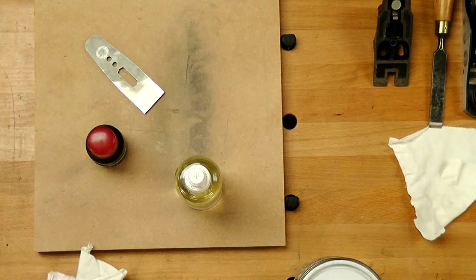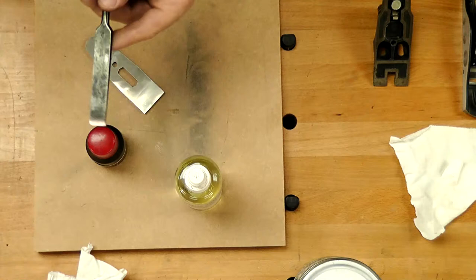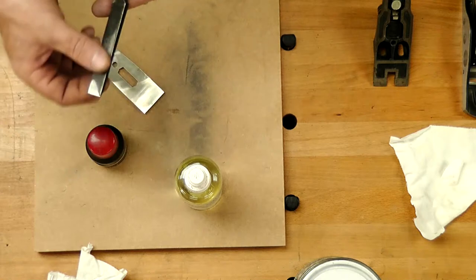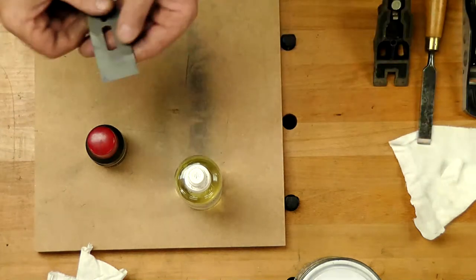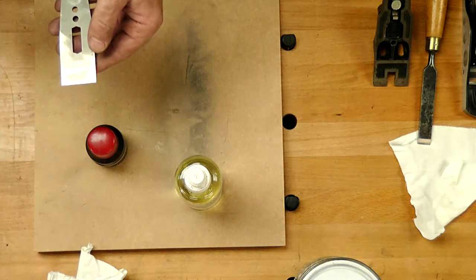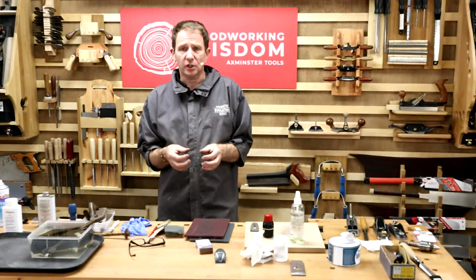All right, Craig, come in then. What have you got? Yeah, Maria's asked, if rust on a tool has got so bad that the surface is actually pitted, is there anything you can do about that? Does it matter? It's a lot of hard work. Depends on how deep the rusting's gone in and what it is. Something like the chisel that I showed you, we were quite lucky with, because most of the pitting was on the top. So we managed to take that out. Underneath wasn't too bad. If you get lots of pitting into the surface of the cutting edge, forget it. You could spend more time trying to do it than the tool's actually worth. We had a guy come in ages ago who brought in a set of turning tools that had been left somewhere. They were carbon steel, not high speed.